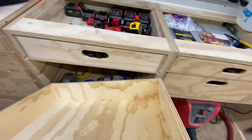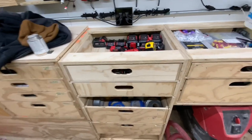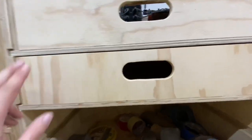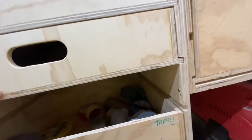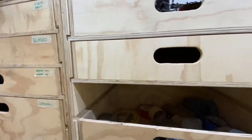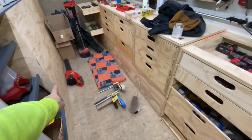We'll see if it works - fingers and a camera make it tricky, but there's the finished product. Just like I said, I wanted about an eighth of an inch clearance, just enough to easily open and close. It's riding nicely on either side of the dados. I'm going to knock out these two remaining drawers, and then all the drawers in the trailer - except for the one eight-footer on this side - will be built. Almost an entire year later, almost all the drawers are built.